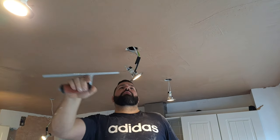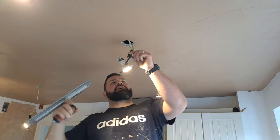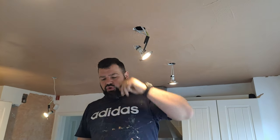I'm careful, I'm not dragging away from them, because what will happen is if you drag away, say I drag away and I catch that little bit of plaster that's dried out and I drag it across my ceiling, it'll score the ceiling, and that's the reason why you clean them out as well.